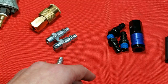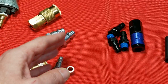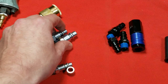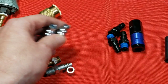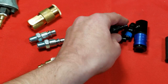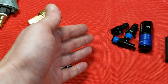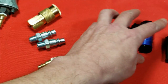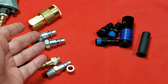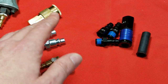Remember, your air flow is always going to be restricted by the smallest orifice. Unless all the tubing associated with your air tank, the regulator, your hose, and everything else is high flow, then you're going to gain very little benefit. Just buying a coupler set isn't going to be the whole thing — you're going to have to upgrade your regulator if you have a small quarter-inch regulator, and upgrade your hose. It's going to be quite a bit of an investment. Anyway, I really appreciate everybody watching and subscribing. Until next time, Catus and Maximus out.